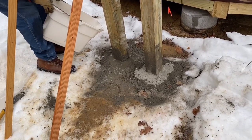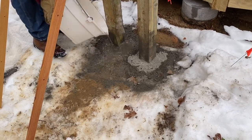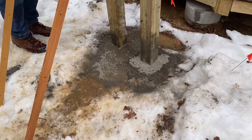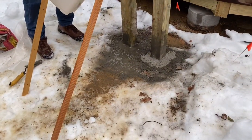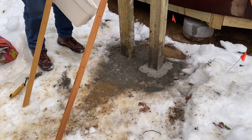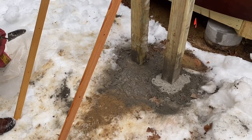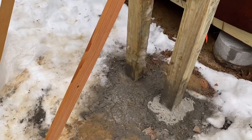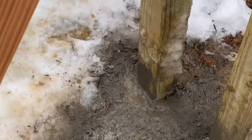It's two quarts for each 50-pound bag. Just put a little bit less in the bag so I can use a little bit less water — it's escaping anyway. It does matter — you're not supposed to have any openings and cracks. Fill that gap with some cement, see that?